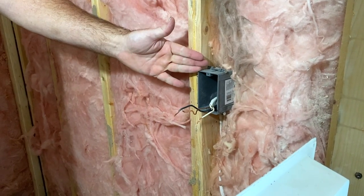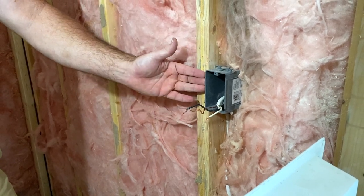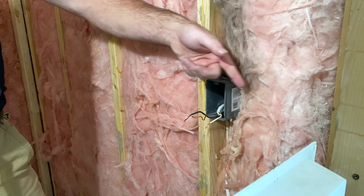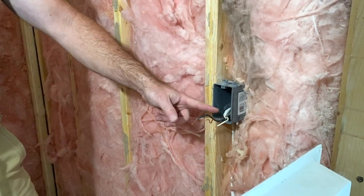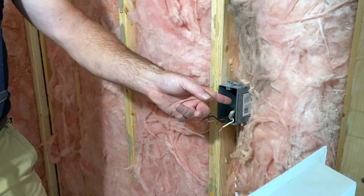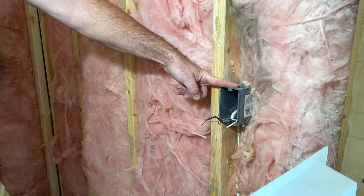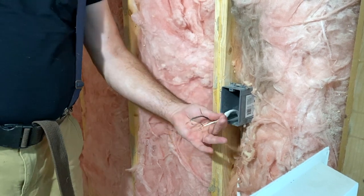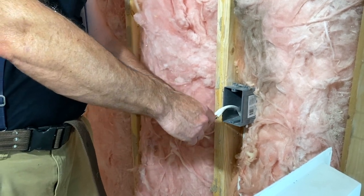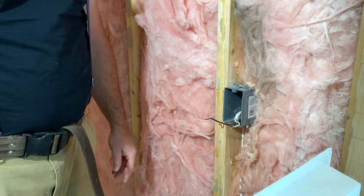This is the way you want your electrical to look when you're done and ready for drywall. We do still have to cut a hole in the drywall for the box to stick through. If the best you can do is a drywall saw, one of those little ones you cut by hand, you'll have to take measurements from the edge of the wall and figure out where the center of the hole is. I have a roto-zip, which is just a small saw with a round blade. It will allow me to cut the drywall out after it's put up — much easier. Go ahead and strip the insulation back; that's going to save you a lot of time when you get ready to put your electrical outlet in.